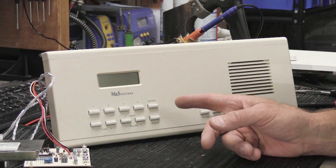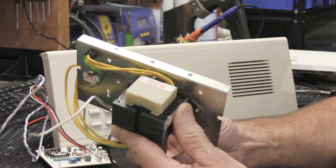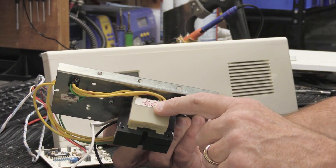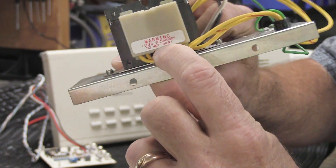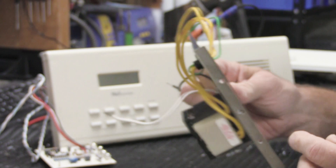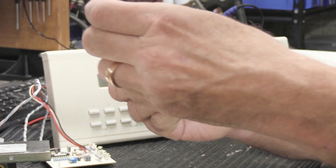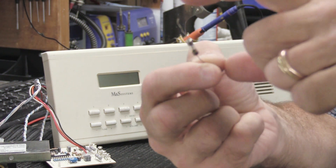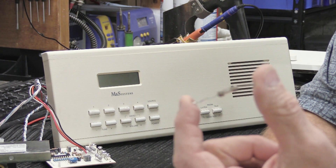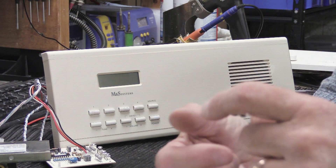Tyson's MC302 has been repaired. The first thing I did was repair his transformer with the blown fuse. The fuse is located under a plastic cover with a label that says 'Warning — fuse secondary, do not short.' So apparently somebody shorted something along the way. The fuse that came out is a little miniature two-amp axial fuse, meaning it has wire sticking out of each end because it has to be soldered onto connections inside the transformer underneath the plastic cover.